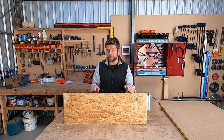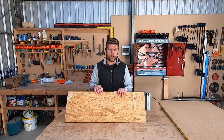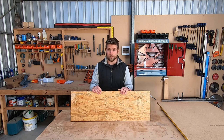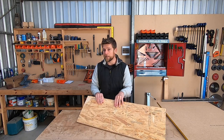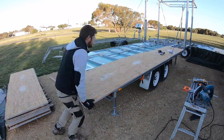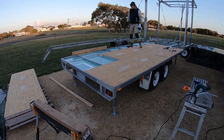I know this will bring out the formaldehyde concerns, but the OSB I'm buying is made with formaldehyde-free glue and its emissions are tested to an Australian standard. It's important to note that all the manufactured products we've looked at may have some level of VOC or formaldehyde unless you're going pure timber. I've attached the OSB by laying it lengthwise along the trailer — the major axis or long edge must be perpendicular to the ribs. I've used a polyurethane sealer on top of the joists to stop movement and squeaking against the metal ribs, and I've offset the end joints of each board for added strength.